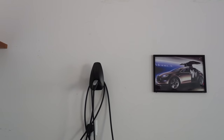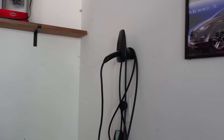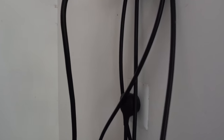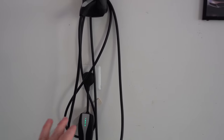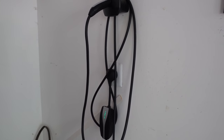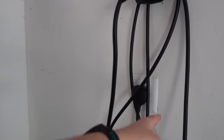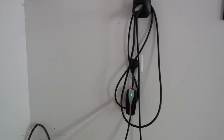Your other option here is you don't have to do a wall charger — you can do a NEMA 14-50, which is what I use right now to charge my Model Y. But going for this next install, I knew I was parking outside and I wanted the wall charger. While a NEMA 14-50 is rated for outdoors, I thought the wall charger would look a little better outside and be a little more protected. If you don't want to spend that much, the NEMA 14-50 outlet costs maybe $20 to $30 at the store versus $500 for the wall charger, with wiring being a similar price. And while the charging speed is lower, it's not all that much different, especially charging overnight — you're probably not going to notice any difference.